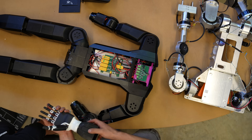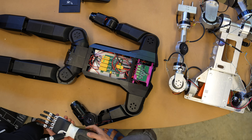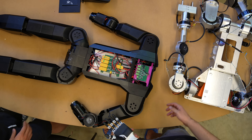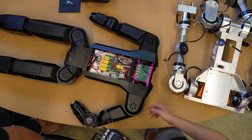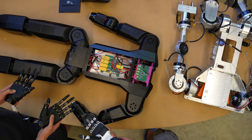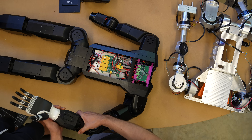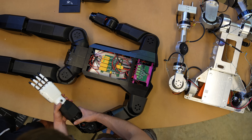Looking at the end effector on the left arm — previously we were using a simple proof-of-concept claw-type rack-and-pinion gear hand. Thinking through a generalized humanoid robot, we really wanted to enable people to put their own custom end effectors for any application. We're offering a much better version of the parallel gripper using a four-bar linkage design instead of a rack-and-pinion — it will be much smaller. There will still be the option to order hands; we've been testing different suppliers for five-finger hands, though we're not yet making our own. Currently it's mounted using an off-the-shelf Micro Four Thirds camera mount, giving a nice user feel with borrowed tolerances and rigidity.